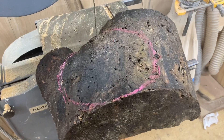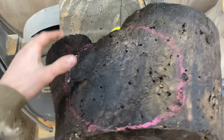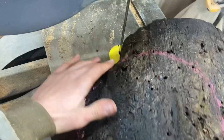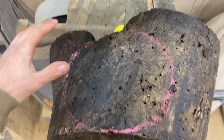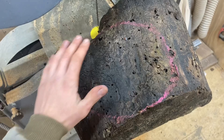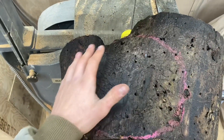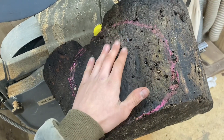On this piece of wood — I believe this is spalted ash — you can see there are two branches coming off here and here. This is called the crotch of the tree, basically where the two branches come together. I've placed my circle right over that crotch because there's usually a lot of really cool grain caused by the two branches coming together, so if you position your bowl right over that crotch you're generally going to get a lot of really cool grain.